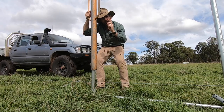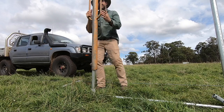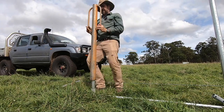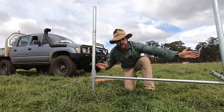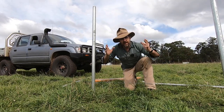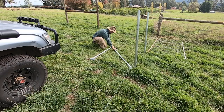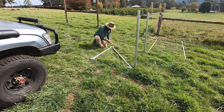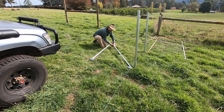Make sure you get the posts straight up and down — don't go with the land — you want your end assembly to be straight at the end of the day. Now that I've started my two posts, I'm going to take my top cross brace off, finish whacking them in and then assemble the whole thing on the ground, same as last time. I like the fast easy assembly of this method. As long as you lay your stuff out right on the ground, I reckon a kid could assemble this.